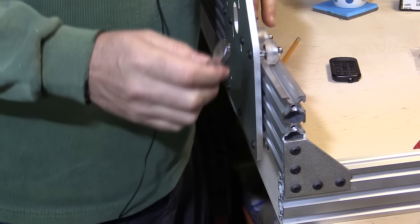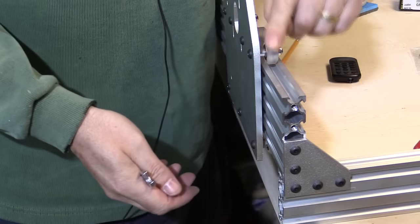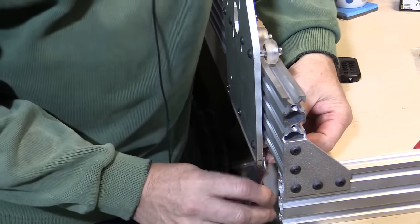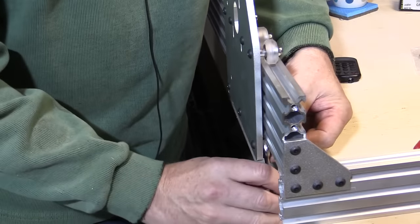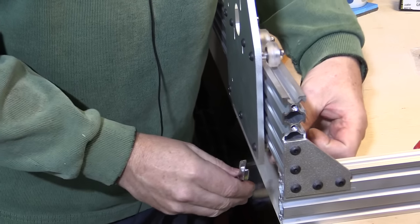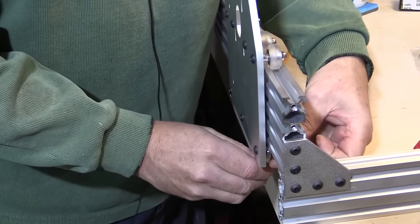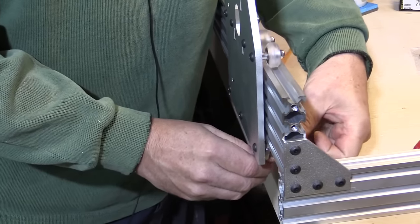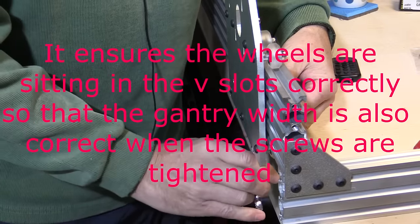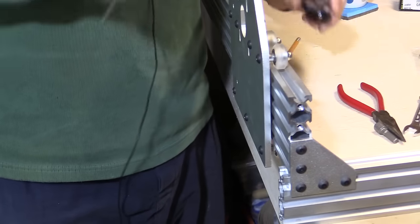One of the things you want to do before putting your plates across is just tweak the wheels up. Right now I can actually roll this without any pressure. What I'm doing is on the bottom I'm taking the eccentrics and turning that nut using a little spanner until the bottom wheel is gripping just enough that when I roll it with my finger it makes the gantry move forward and back. This is just a starting place. Now I can hold it without it moving, and tighten it there — it's much harder for me to roll the wheel without actually moving the plate.